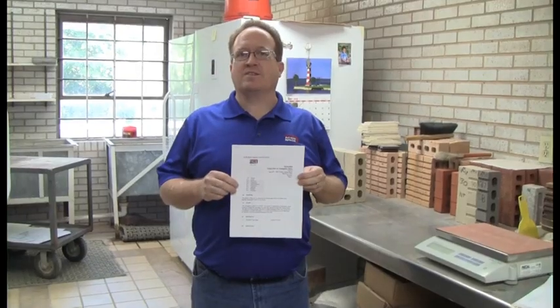And if you're going to do a set of these at the plant, while we're only going to demonstrate one today, you would want to do a set of 5, because that's normally what we do as part of our normal ASTM testing. When we get a set of brick in to do the IRA, the first thing we're going to do is dry them out for at least 24 hours at a minimum temperature of 250 degrees.